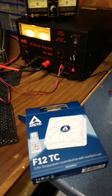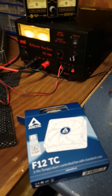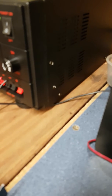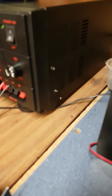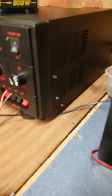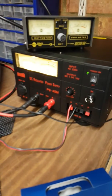The other thing with the PS40M — the lower casing screw in the center of the picture fouls the main power leads going into the power switch. The leads are quite protected, but they're only protected by their sheathing and not against the metal of the screw, so I'll put a piece of plastic in there to stop that. On the other side there's a bunch of wires which run along the casing as well.